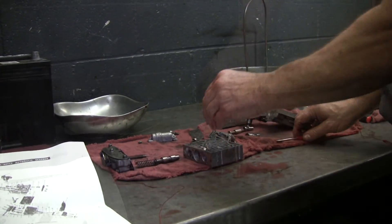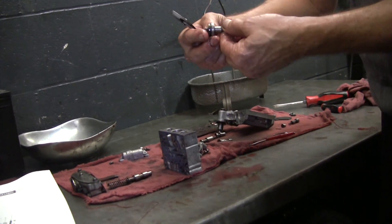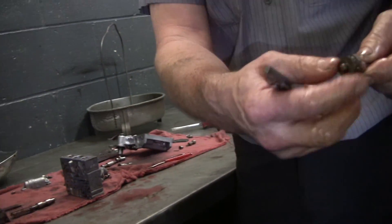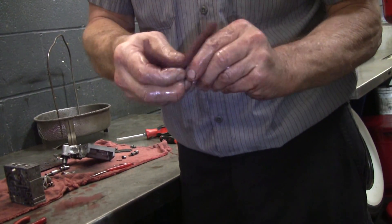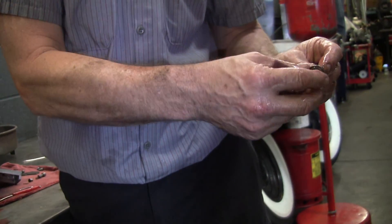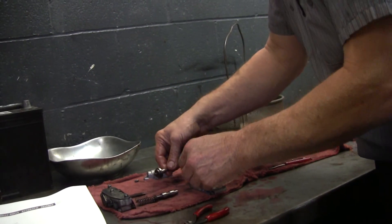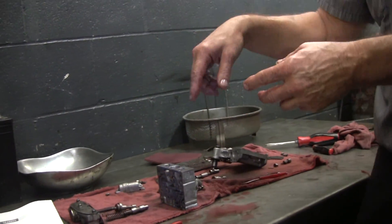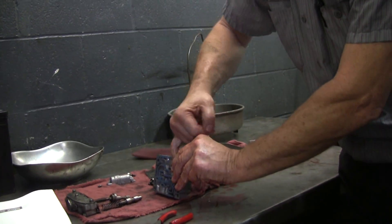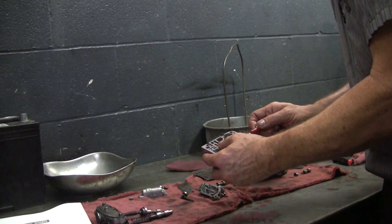That one's kind of stuck — it takes a lot to move. You can even see there's garbage on it from pulling it out. That valve should look perfectly smooth and shiny, not all scratched up like this. There's a lot of garbage in there. You've got to be really careful — I don't have a problem scotch-briting steel, but aluminum will start going away. This thing is just gritty, so we're finding more and more things that would cause it not to shift properly.